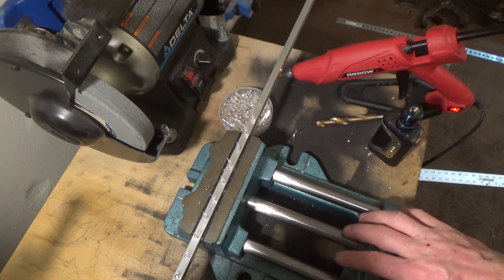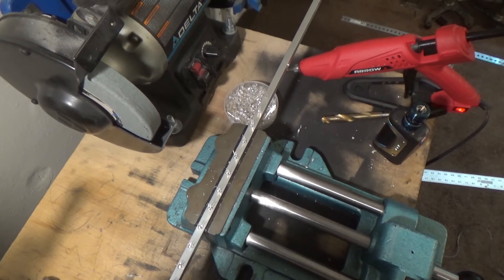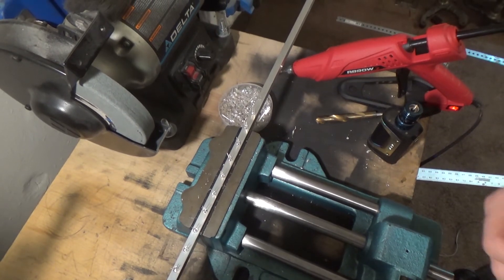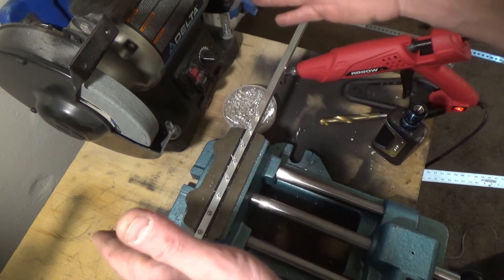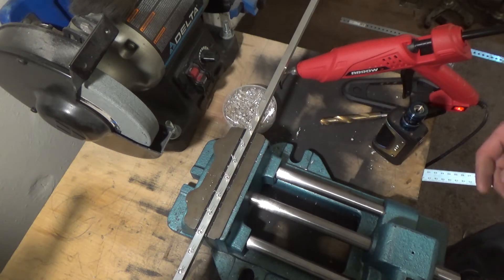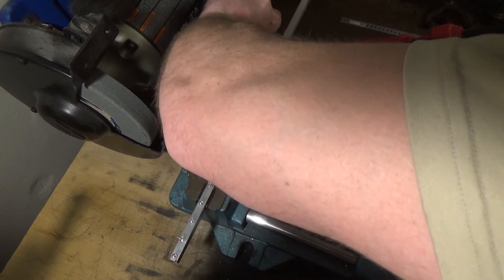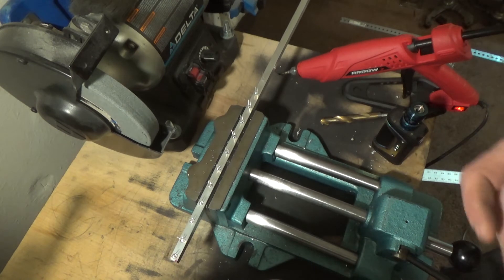As you can see, we have diffused LEDs here - 5mm and they are all bright white. These are some knockoff eBay ones. So the way these are going to work is I'm going to stick this 12-inch bar in the wall of the trunk - left and right side fenders. As he opens the trunk, light is going to shine down in. You don't have to have that weird incandescent dome light thing, which nobody wants because the bulbs always blow out - they're high draw for amperage. But like I was saying, these are not voltage-specific. LEDs are not voltage devices. They are constant current devices.